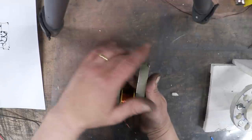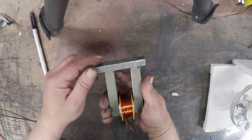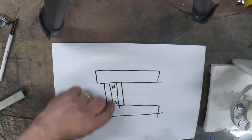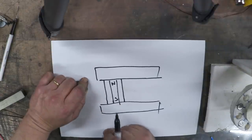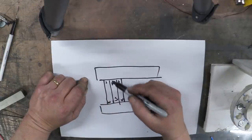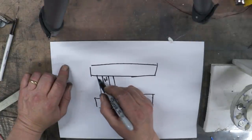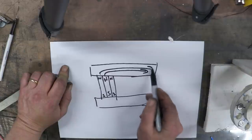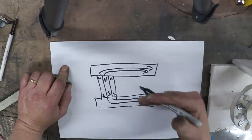The magnetic circuit isn't fully saturated, so there is a little leakage at the end of the magnet — we get a very slight attraction there, just capable of holding that block. Now when I pass a current through the coil and make both ends the same pole — south/south or north/north — there's no longer any leakage; we lose all magnetic attraction at the end. But if I reverse the current direction, making that end north and the other south, we have two magnets working together and all of the flux goes to the end, giving a very strong attraction.